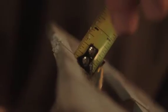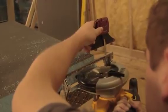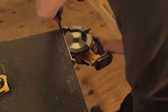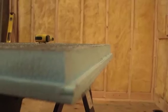When cutting channels into bases featuring four-way slopes, it's recommended to make the horizontal cut using a utility knife along a line parallel to the flat underside of the base so your channel has the appropriate and even depth. Once the channel is cut, remove all foam dust and particles.